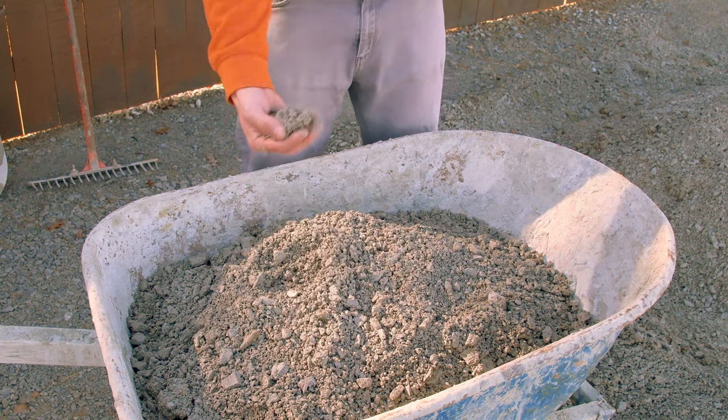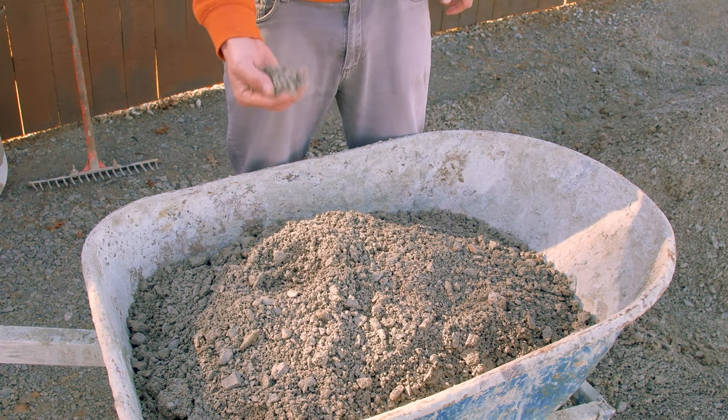You might be wondering what type of rock we recommend for our projects. For your basic fireplace feature or grill feature, we recommend using a road-base material — and that's a general term. Across the country it's named different things: dense grade, CA6, crusher run — it's all a one-inch aggregate down to dust material. If you want to know how to order it, don't get too caught up on the name. Just check with your local supplier and ask for road-base material, and they'll point you in the right direction.